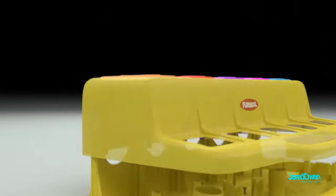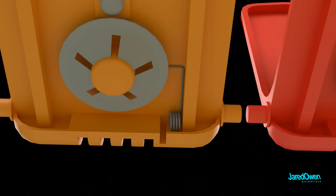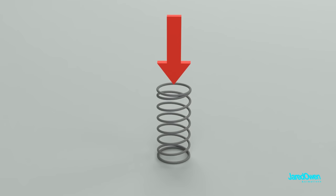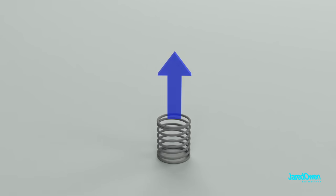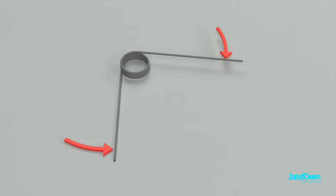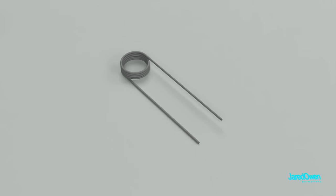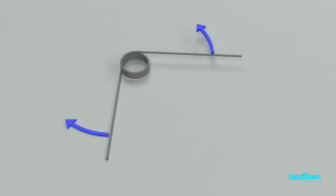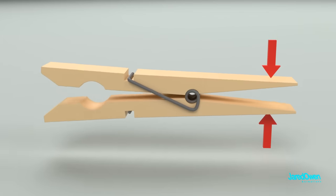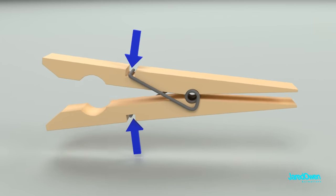On the bottom of each door, there's a spring that causes it to rotate to the open position. In this video, you'll see two kinds of springs: a compression spring and a torsion spring. You're probably used to the compression spring — the more you press down, the more force presses in the other direction. The torsion spring works a little different; it works by twisting. The greater the angle of rotation, the more it wants to twist back into place. A great example of a torsion spring is on a clothespin. Pinch the very ends and the spring in the middle is twisted — you can feel the force that wants to pull it back together.